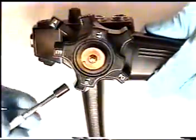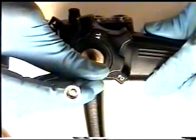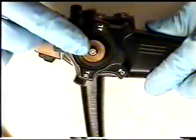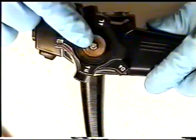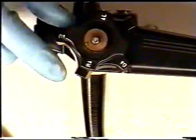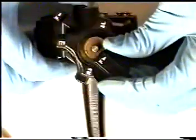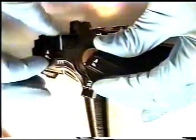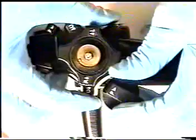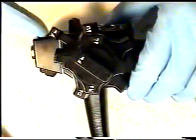Retrieve your second nut and screw down carefully onto the first nut. Again, only finger tight. Do not apply excessive force to these nuts on the shaft, otherwise it will break the shaft. Once the nuts are down and a small amount of Loctite is applied, we will take the left-right locking free cap, and being sure that the up-down is in the free position, we will match up the left-right free lock with the up-down so that they are diagonally equivalent.